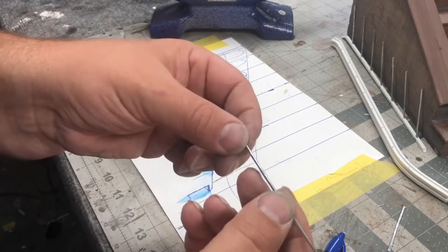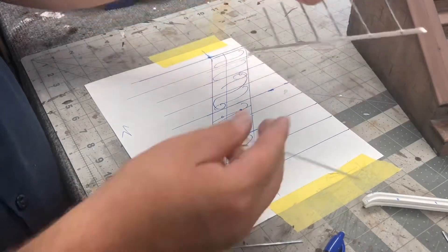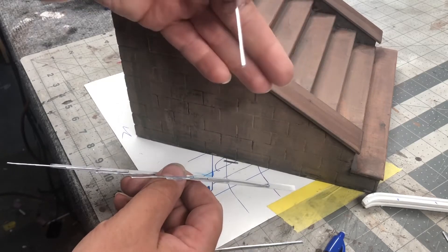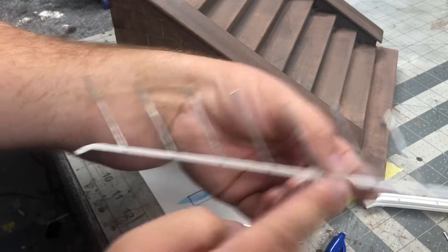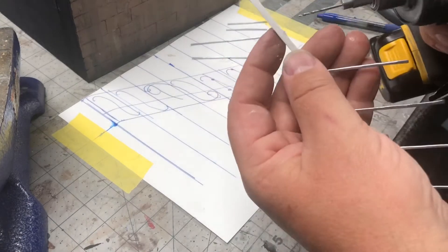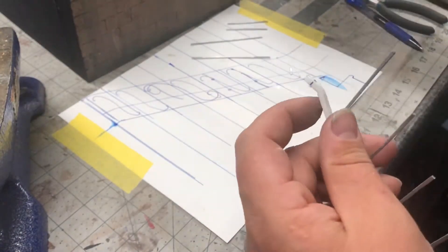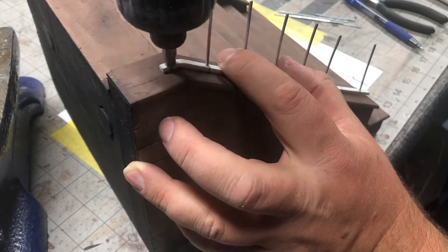I decided to go with three and a half inch long pieces so that when I pre-drill my hole into the steps it would go a little bit deeper than an inch — about an inch and a half — providing some nice stability. It's obviously not gonna be bulletproof, but it will prevent it from breaking off if somebody bumps the railing or picks it up too roughly. I'll pull this one out, add the other one, and drill all the way through on that second rail position as well as the top rail position, which will allow me to anchor the railing much stronger than just at one single glue line on the bottom.